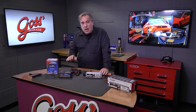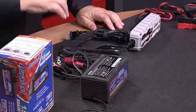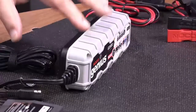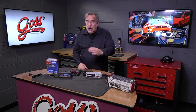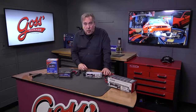For stationary generators you may want to use something like this. I'm actually using this one on my 30kw whole house generator at home because the built-in maintainer has failed and it's several hundred dollars to replace. But you have to make sure — if whatever you're trying to maintain is going to be outdoors — that you get one that is water resistant. I don't know of any that are waterproof, but water resistant so they'll stand up to outdoor use.